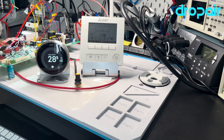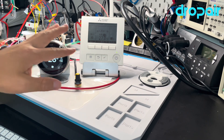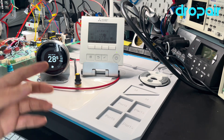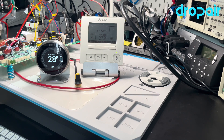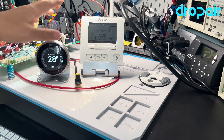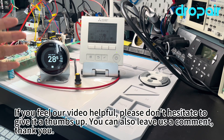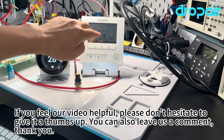When the Nest needs to cool again, the set point will be set lower than the room temperature, so the original thermostat must obey the Nest to cool down the room. The room temperature will be controlled by the Nest, not the original thermostat. You do not need to worry if the original thermostat is installed in the ceiling where the temperature may be higher than on the wall, because the Nest controls room temperature, not the air flow temperature.